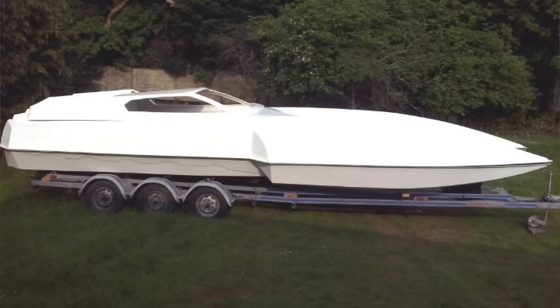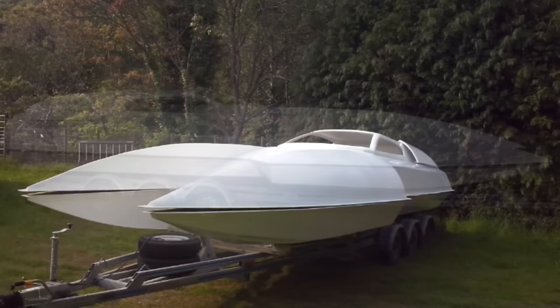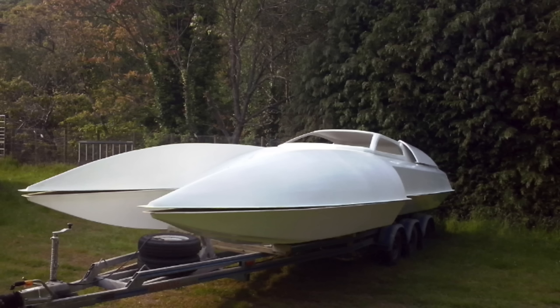The shape of this boat is loosely based on an unlimited hydroplane, which is an American racing class, but this is a lot tamer — it has much more freeboard and much steeper angles of deadrise, so you can actually go out and use it in a bit of chop. The profile was designed using CAD, then refined using computational fluid dynamics, so we've got a really low coefficient of drag.